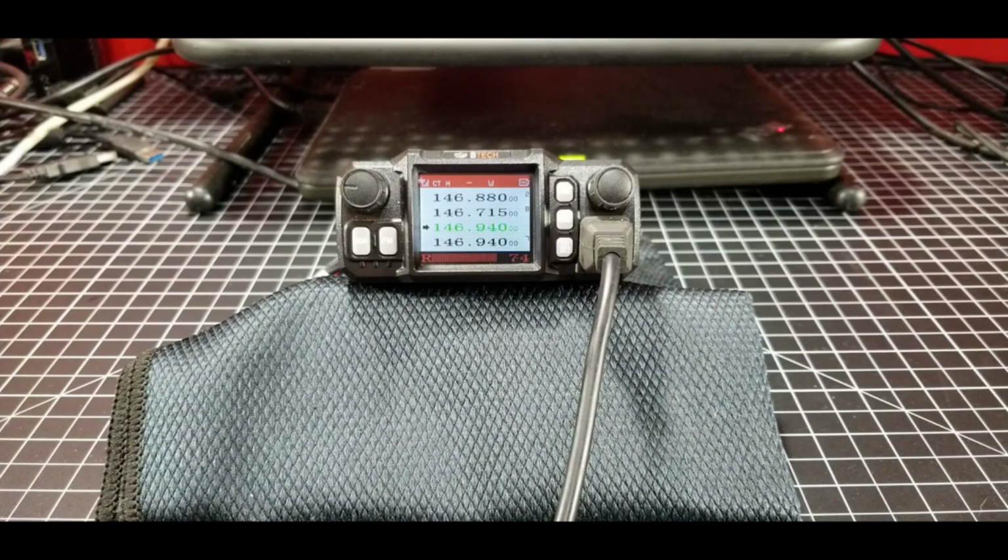Got a full repeater identification, so we must have it programmed correctly, because it activated, so we know we have the transmit tone correct. We received, so we know we have the receive tone correct. So we did get it programmed correctly. And we'll wait just a minute or so, maybe just a few seconds, to see if somebody comes back. There may not be anybody listening or handy. It is a fairly busy repeater at times. But since I'm testing, they may not bother to come back. And we're not hearing anything right away. But that's okay. We were able to verify that the repeater is working.